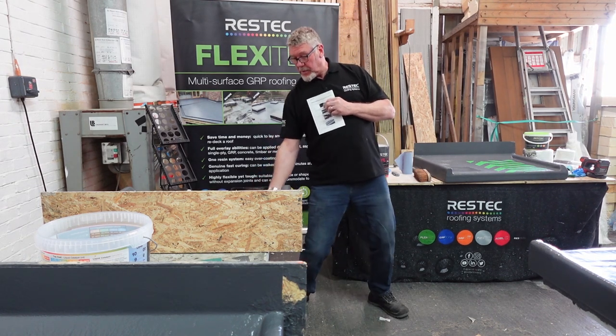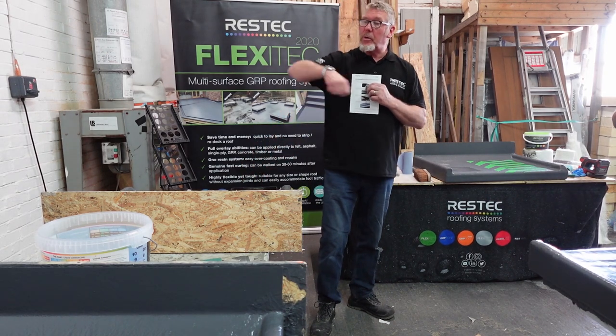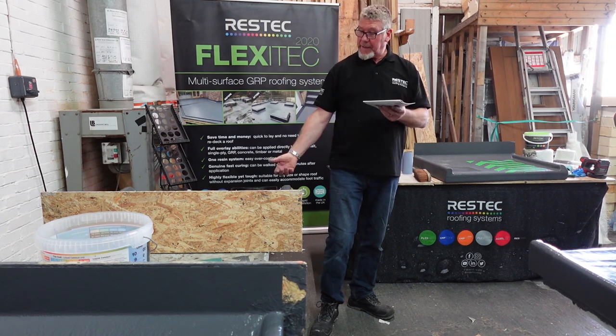Don't forget this bit here, you're going to have a gutter underneath there, and your client's going to look there 6 times a year and clean all the gutter out, make sure it's spotless. How the hell is that? You get full of crap. Condensation is going to get to the timber.